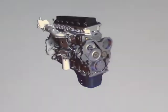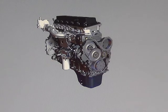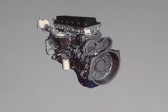The flywheel housing seals the rear gear train. An access panel in the flywheel housing allows access to the rear camshaft gear without removing the flywheel housing. The rear crank seal is a press fit design.